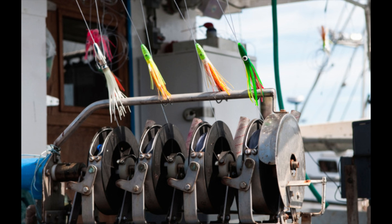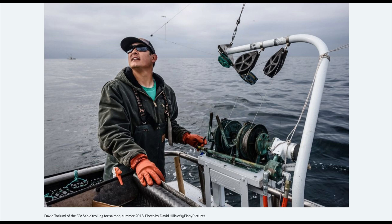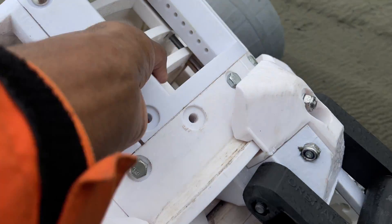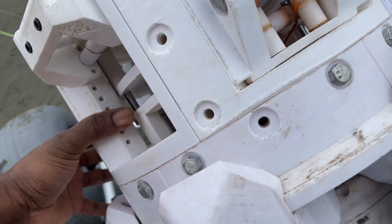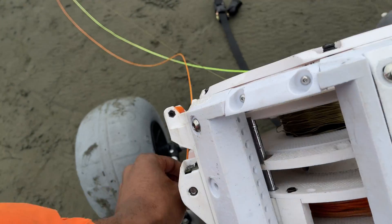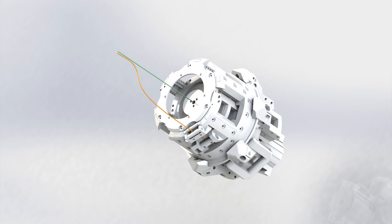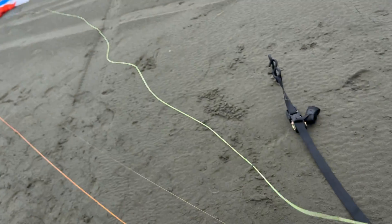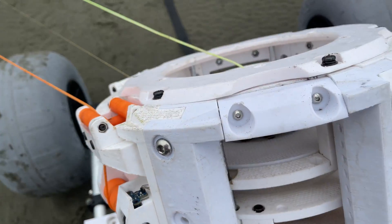It's not clear to me how other businesses handle reeling in line that's been crashed. We use industrial commercial fishing equipment — these guys are probably the most qualified for dealing with high-tension lines. We came up with a solution where you pull in this clutch and the whole assembly rotates, so you can straighten the lines out even if the kite crashes in the air, preventing the lines from twisting together. This makes it much easier to launch and retrieve the kite.